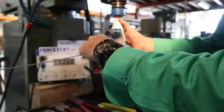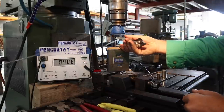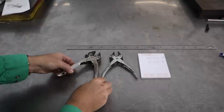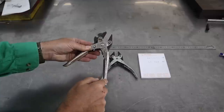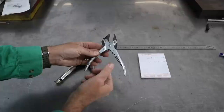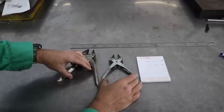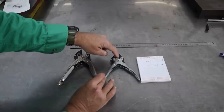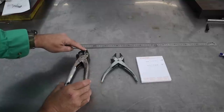Next up are the Baby Morns — smaller, so one would expect poorer performance. Bizarrely, result: 408 newtons. We've identified two reasons why. With these pliers, you've got two independent moving parts. The shorter the pivot-to-jaw distance compared to the handle length, the more force multiplication you have. In this set, the distance between the two pins is appreciably smaller, and the handle levers aren't as long. Also, with both pliers opened wide, they have about the same grip distance, but the travel distance at the jaw is much smaller on the Baby Morns — so the same amount of force is concentrated over a shorter distance.